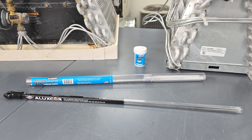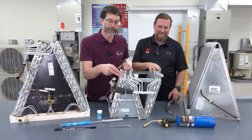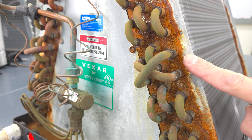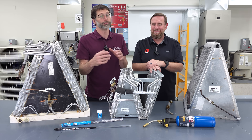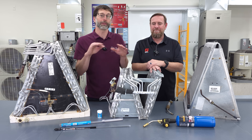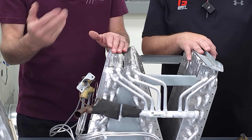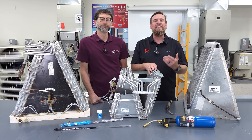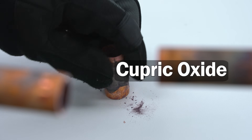The melting point of these rods, and also of the aluminum tubing, is a lot lower than the copper tubing. A lot of times we had leaks right where we had the copper tubing going right through the galvanized tin. We had a dissimilar metal connection, as well as maybe acidity in the system wearing down the inner walls of the tubing and making it thinner. So we would have refrigerant leaks in the copper tubing. When we also had to do repairs before with the copper tubing, we had to use a lot more heat, which led to copper oxides building up, or oxidation inside the tubing, and we had to flow nitrogen to prevent that.